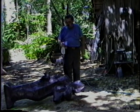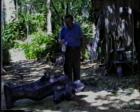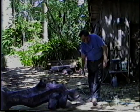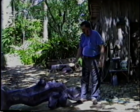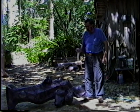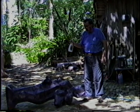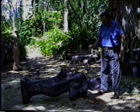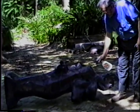This has been washed with a dilute solution of sulfuric acid. If you put on the ammonium chloride, the greening solution, first, the liver of sulfur won't take. It has to have a fairly clean copper surface to work on.